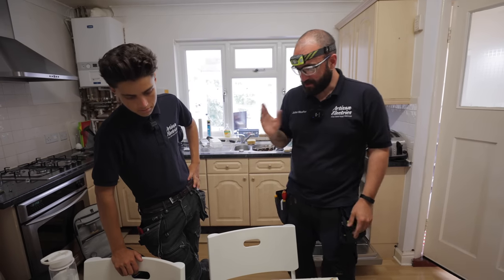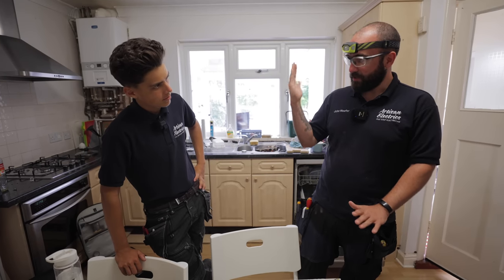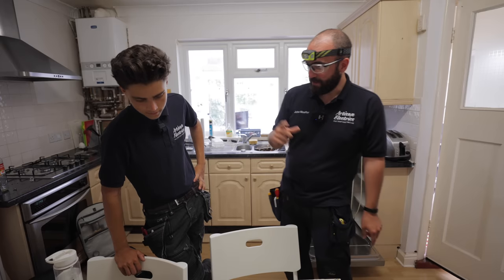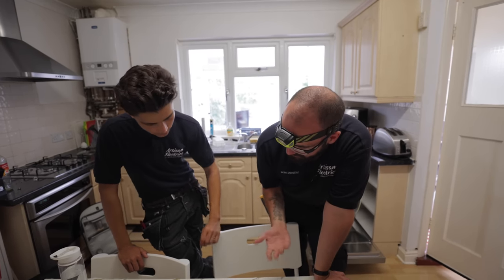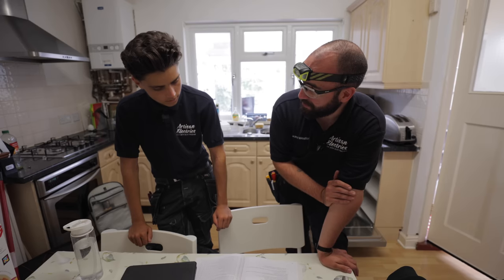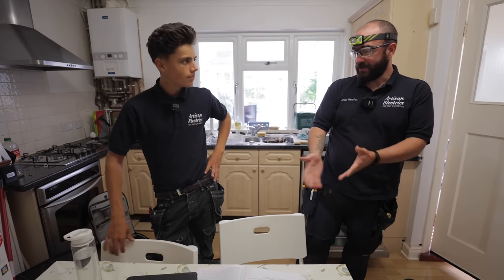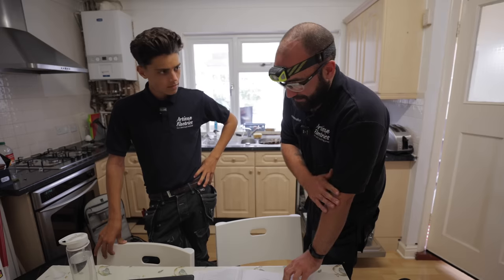So it's a short circuit, so live and neutral, live and earth touching. Inrush, and it'll turn off within 0.4 seconds, and then that's the overload side of it. So there's no way of actually testing it to see if it works. So all you can do is do the maths to prove theoretically whether it will turn off, because you're not allowed to just do a short circuit to see it turn off. Yeah. So that's why we do these tests, to prove it will turn off. And essentially that's all there is to it.